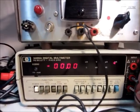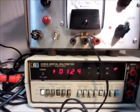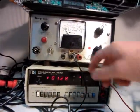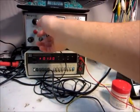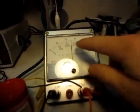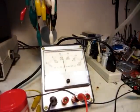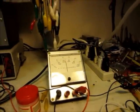The short circuit current right now - I saw about 50 milliamps for a second, then down to 20, so it's not very good just sitting here. I don't think I charged it up before I let it sit. I'm just going to let it charge up during the video. I charged it at 2.5 volts and it's drawing about 45 to 50 milliamps.